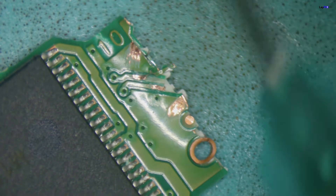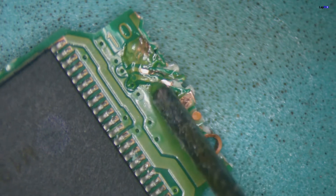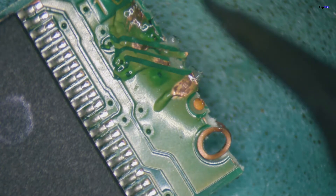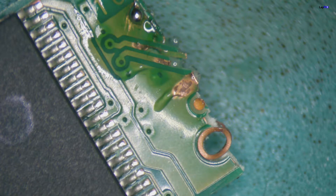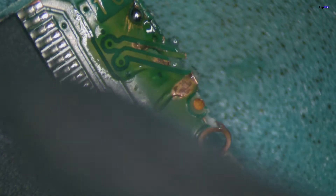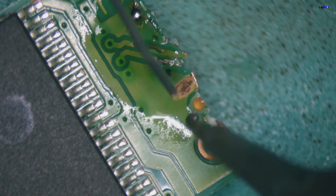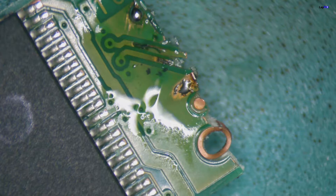We apply flux to clean out any debris and make it easier to solder. Then we put a small solder dot on each exposed copper scratch we made — one for each trace. This is very difficult and precise work. Each solder dot will act as a connection point for the wire we solder back on. If anything intersects or goes over the line, it won't read and you can short something — so we make sure everything is perfect.